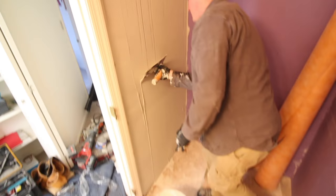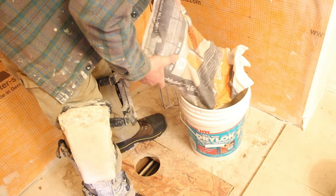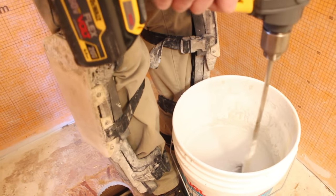Always make sure you follow the directions of the manufacturer that made the shower tray or shower pan. If you're building your own, try to follow the TCNA Handbook. We actually waterproofed the walls before we put the shower tray in. The next step was to flood test everything and make sure it was waterproof. The second thing we did was choose the right bonding material — in this case, Schluter's Allset, mixed per Schluter's specifications.